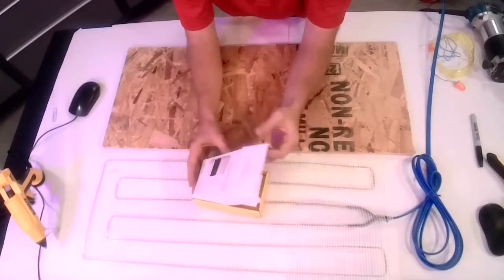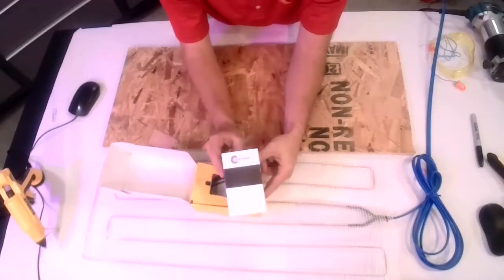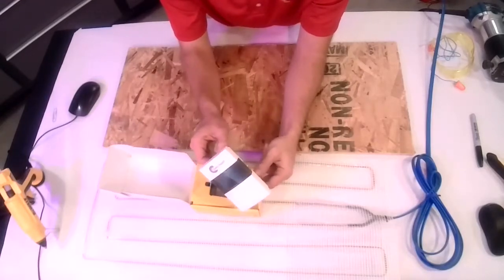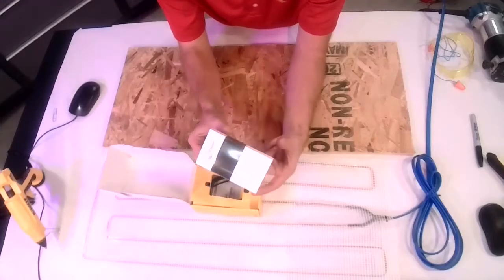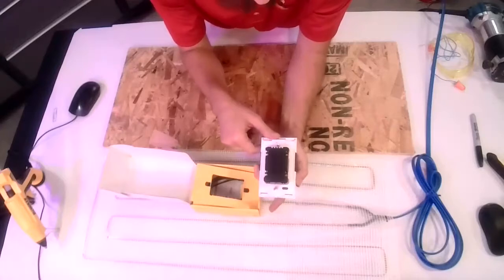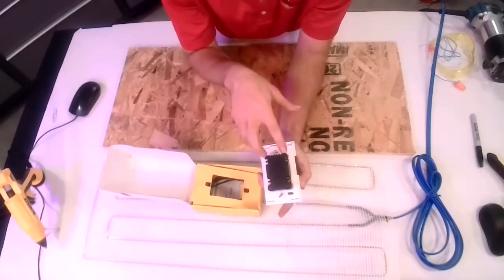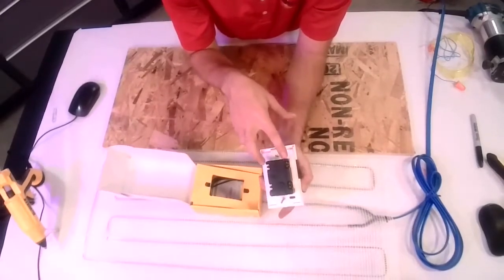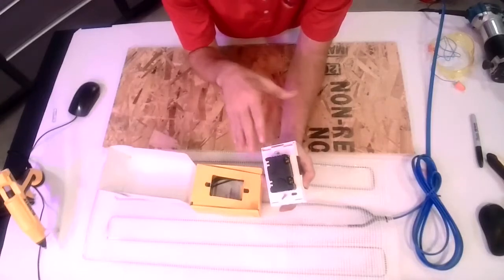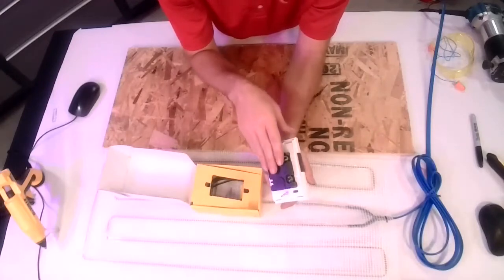This is our basic thermostat that we sell and include with both black gold and Gold Heat. It is what's called a line voltage switching thermostat, and what that means is it directly takes the 110 or 220 volt power through on this side. I probably won't be able to see it, but the bottom terminals are marked line, so that's the line voltage, and the top terminals here are marked load, which is your output. So this would be either tied to your one or multiple mats up to 100 square feet if you're in the 120 volt space, but it can also be run on 240.